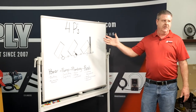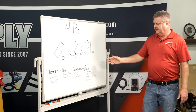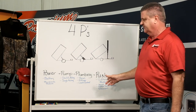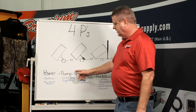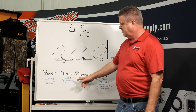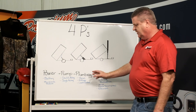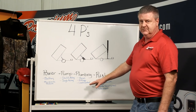We like to call this the four Ps. It starts out with your power source, then your pump, then your plumbing, then your push. When it comes to the hydraulic circuit on your trailer, there's a variety of ways to get there, but you can't get away from the four Ps. You've got to start with your battery and do good battery maintenance or you're going to have problems. Then you go to your pump — you can go either double acting or single acting. Single acting does have less amp draw, but you don't have the ability to have that secondary check if you want to load equipment with a ramp. Then you go to your plumbing — your hoses, your fittings. You need to clean those when you make them, or if you get them from us we'll ensure that's done. Also make sure you've got something in case there's a hose failure — we use a load control.